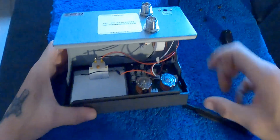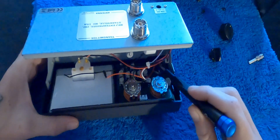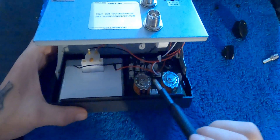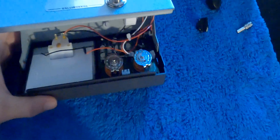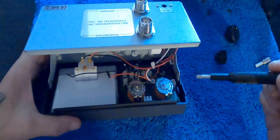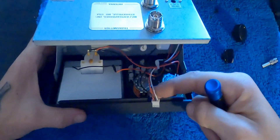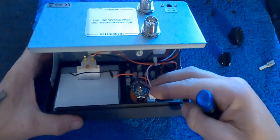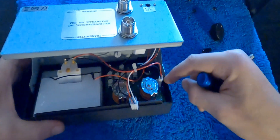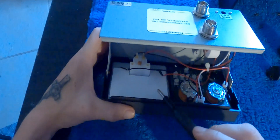Before you pull it off: this is your knobs right here — this is your calibrate knob, this is your range, and this is your function. This is your meter, and you're going to have to undo the connectors — the top three wires go into your top connector, and then your two-wire goes onto the side connector here. You do have to remember that.